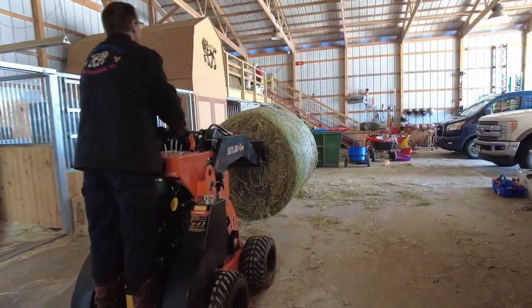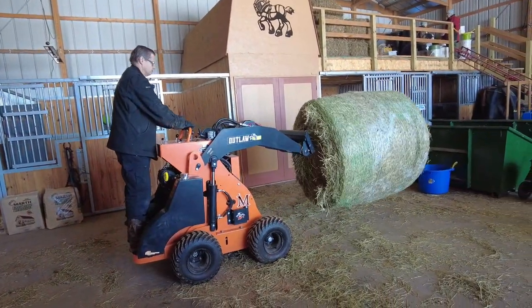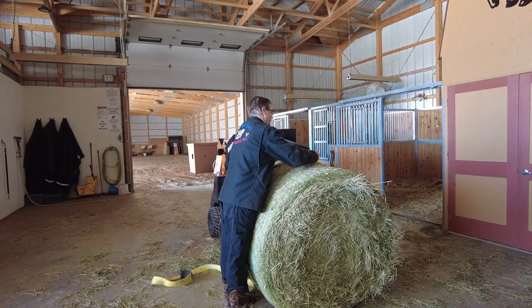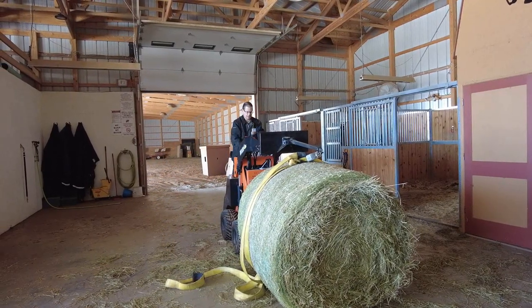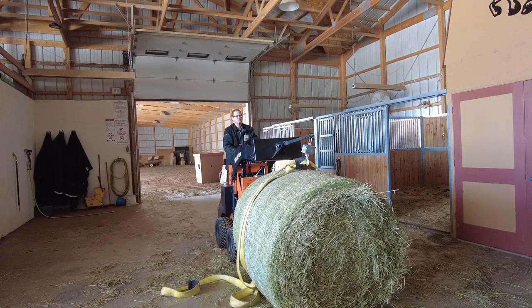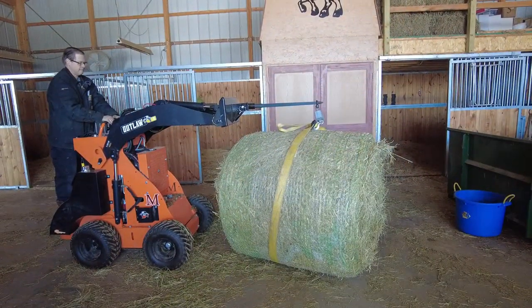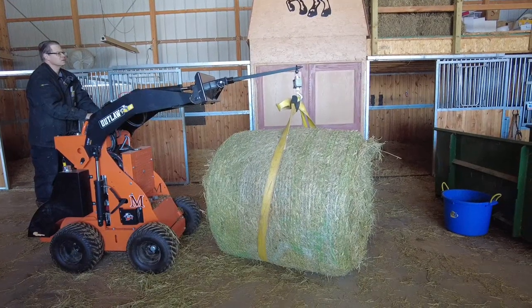So I'm going to bring it back into the barn area, throw a strap and a scale on it, and see if I can push this beast a little bit. I want to measure this bale and get its weight, and then push the tippiness and see what we can do. Right next to the plate it should be able to lift about 1600 to 1700 pounds, and as you go away from the plate the tipping point decreases. So I took a toe strap around the bale, put one of my crane scales on it out way at the end of the spear tip — I want it as close to the tip as I can, about four feet out — and I want to see what this thing can do.